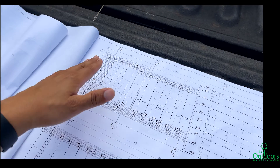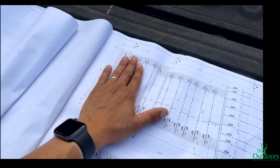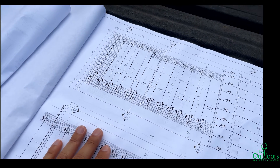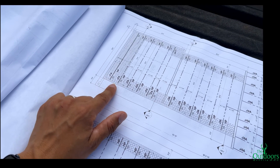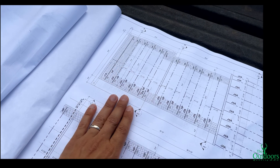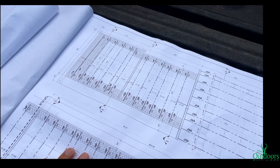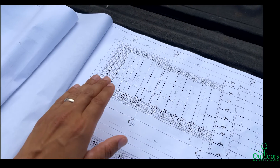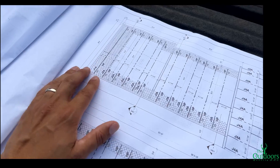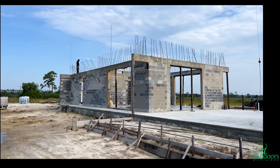What changes is the webs — they were different. I still hadn't come back to look at my plan, so I told him okay, just go ahead and maybe it's an error from Canom. But no, there was no error. Yes, there's only one J1A — you can see right here — and then the rest are J2A. So just make sure you're reading your plan. Go back if you're not sure, and if there is a problem contact the truss manufacturer to check for errors. In our case everything was fine. So far we have two joists up — the J1A and the J2A.